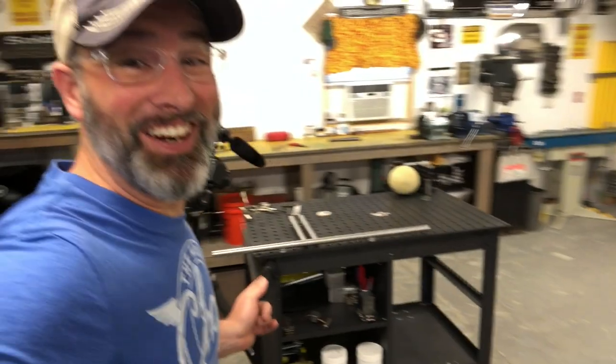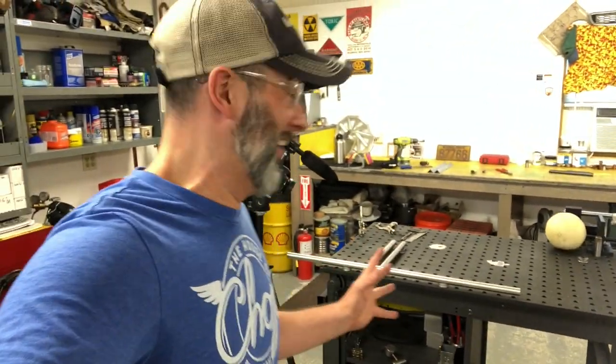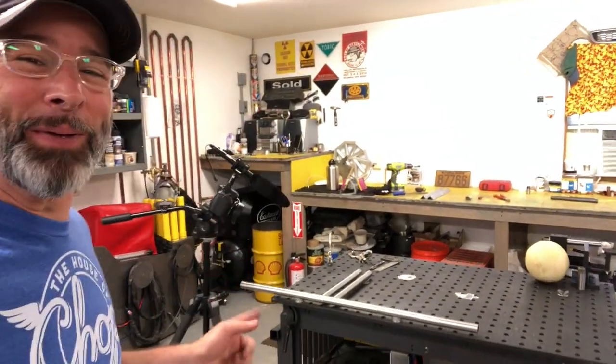With all the final cuts made over here, we're nearing my favorite part. The part where I get to melt steel with electricity. Got a little bit more deburring to do. Gotta clean everything up, give it a nice acetone wipe. We want a TIG weld with super clean metal. Ooh, and that's off to the races.